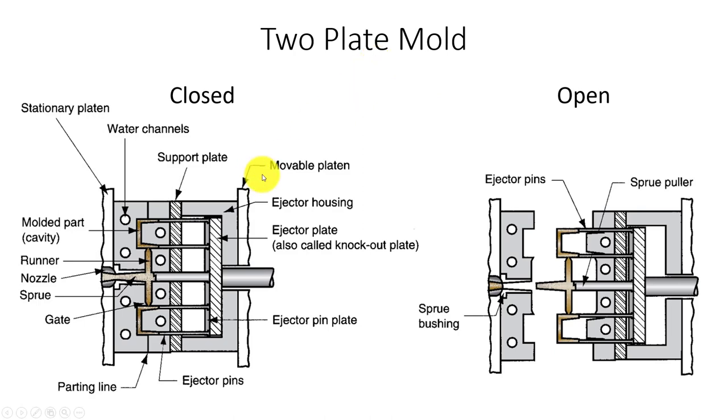You're dealing with a two-plate mold. In an industrial mold, plastic goes through the nozzle, through the runner system, into the cavities through gates. Gates control the flow rate of material into the cavity — there's a lot of technology around edge gates, submarine gates, and ring gates. A polymer injection molding and part design course is really neat — I've taught them using SolidWorks, learning design techniques for parts and molds, running simulations on injections so you don't spend money making expensive dies before validating the design.